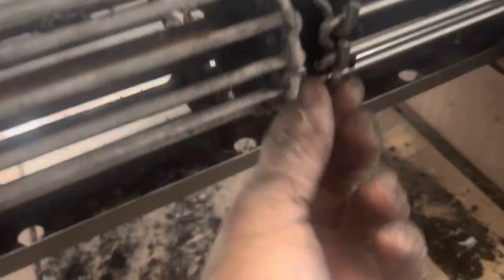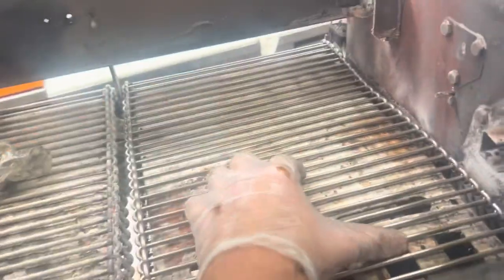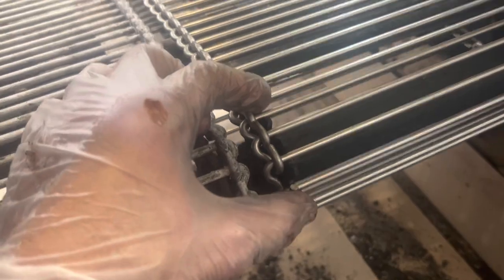I bring it to the back and keep it loose, and then as it runs through the cogs you can see — when I first did it I had one more link, I cut this link out. To be honest it was fairly tight and it hooked real easy because I had an extra link. There is no extra gap. What I mean by that is right now I'm toothed on the front square, I'm pulled tight, and I'm toothed on the back.